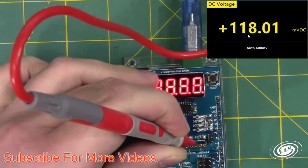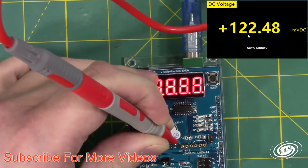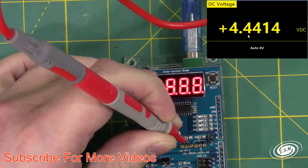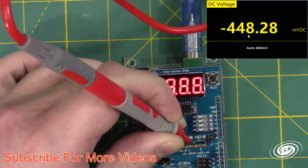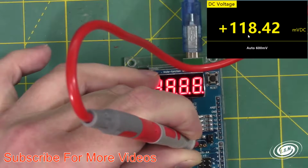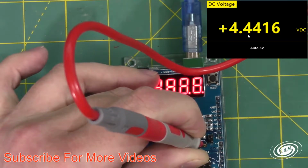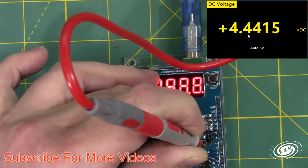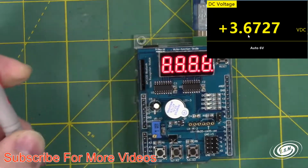Getting something, but not what I thought I was gonna get. Any one of these have voltage? Okay, that pin has 5 volts. So, I thought for this LM35, one of these would have a voltage, and then it would send millivolts. Okay, it has 5 volts on the one I thought was the A4 pin. So A4 must be connected to the LM35 middle pin, which would make sense if that was the gate.